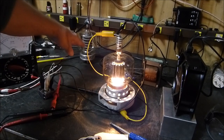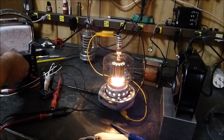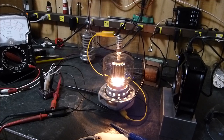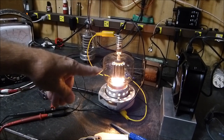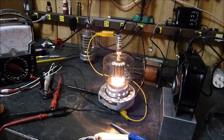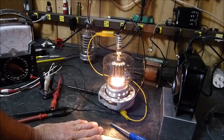On the good tubes, running it up to 100 volts, it was down around five or six hundred milliamps — very steady, never did anything like that runaway behavior. So per the procedures in the article, you can put 44 volts on it and get approximately 350 milliamps of current. But that doesn't mean the tube is good when you really start stressing it. If it's gassy, that tells a different story.